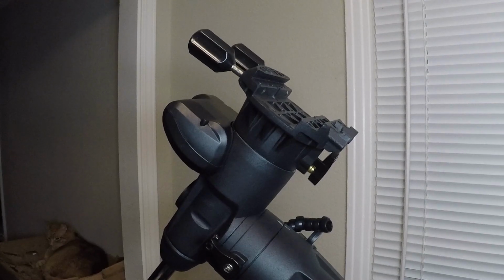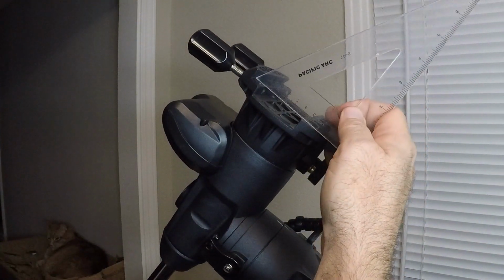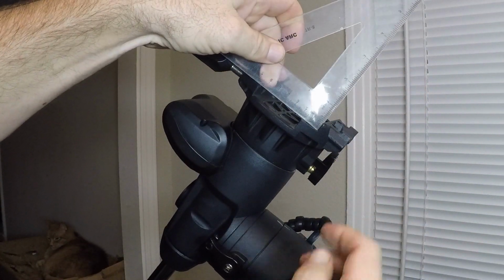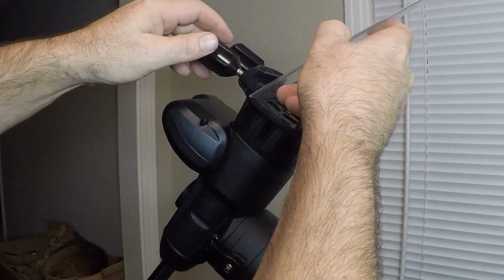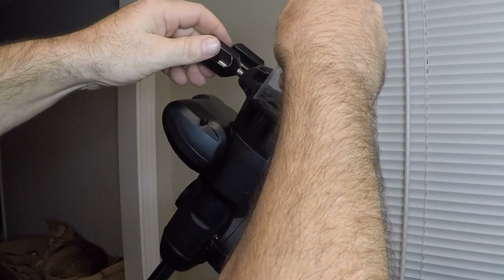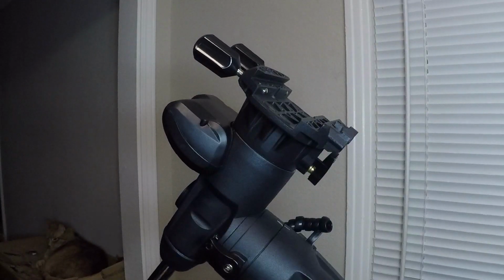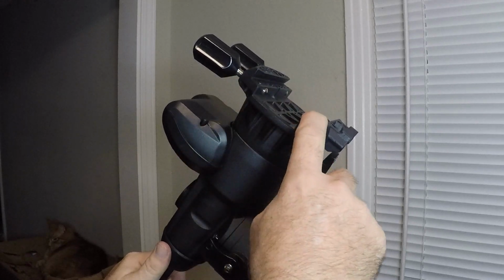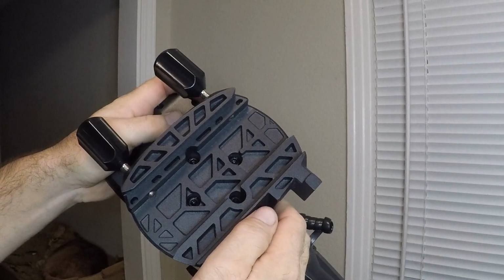Okay, so you can sit here and eyeball this with the protractor all day long. I can take a picture of it and measure the angle in a picture, or I can just use my drawing triangle and come in here and go, yep, okay, that's a 30-degree angle, no problem. The other side looks like a 90-degree angle, but that wouldn't work. The screws come in a little bit and catch the side. If it's vertical or a 90-degree angle, it can slide out. You want a little bit of an angle there so the screws actually trap it in and hold it. Okay, I don't think it needs to be a 30-degree angle on the other side. I think a little bit less will do. Okay, so that's what I need to do. Next step, draw it up, then CAD it up.